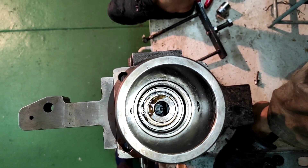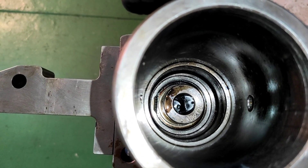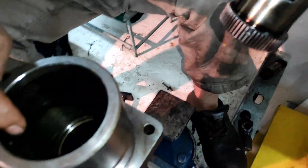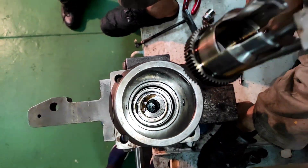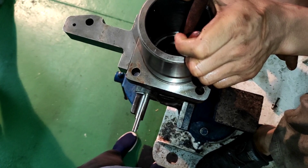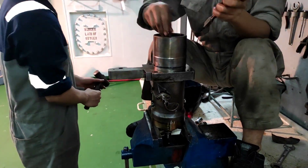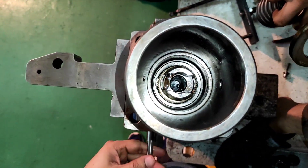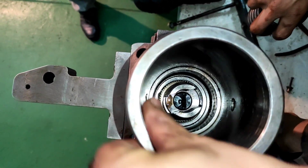First we will put the control sleeve. Now our rack is freely moving. We have to put the control sleeve. That control sleeve ensures that this point should match with the zero of the rack. That zero of the rack — then only our fuel pump will work perfectly. See, this is moving properly — control sleeve, zero position. At the pin, it is moving properly.